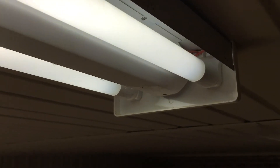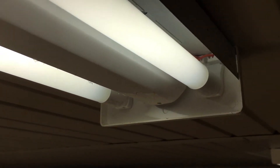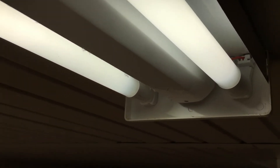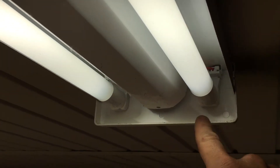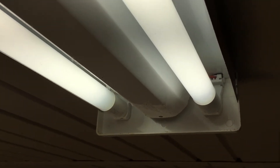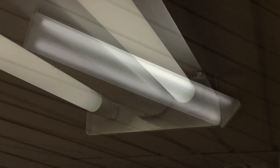As far as wiring goes — the hookup is on one end and there's nothing on the other end. The LED bulbs you order might be a little different, but remember that the line side is your black wire and your neutral is going to be your white. As for the keystone wire colors, it doesn't matter — you just need to remember which way they go. You could take a sharpie and label one side L on the keystone. But since this is my mother's house and I'm the only one that does electrical work here, I'm not worried about it.